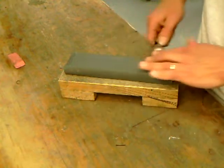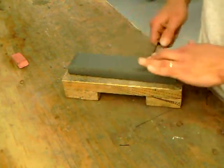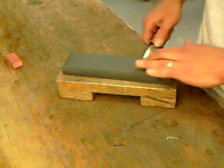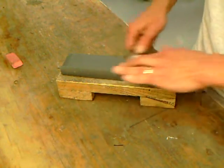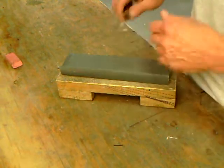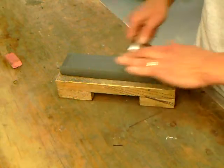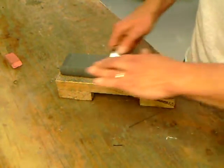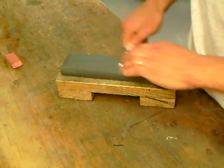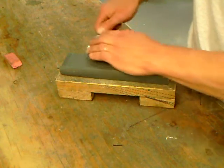Because you're working with a bunch of high points, I'm using just enough pressure to use the points as a reference so I can feel where the apex is. With a little bit of practice, you'll be able to feel exactly where you are on the edge between the shoulder and the cutting edge. And then when you switch to the compound, you're going to use the pressure for a slightly different reason — you can use a little more, especially if you're using the compound for a touch-up, because at that point you're not worried about rounding the edge.